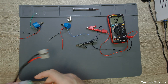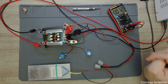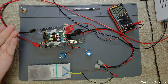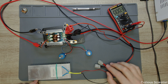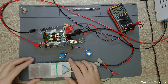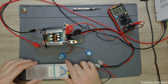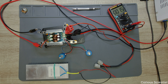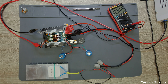I have already prepared the cables so I will just solder them in and test it. Everything is assembled — here we have the DC-DC converter, the input voltage is set to 20 volts and 3 amperes, and the output comes out on these DC wires with clips. It's connected to a load which is a 6 ampere Peltier cooler TEC 12706 model, glued to a heat sink so the hot side can dissipate some heat. This is the CC potentiometer and this is the CV potentiometer, and this multimeter measures the output voltage.